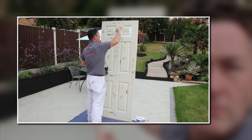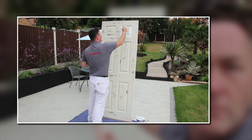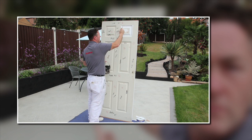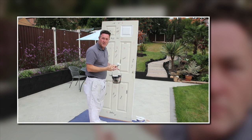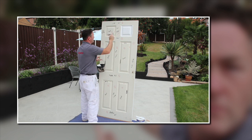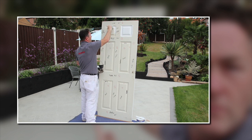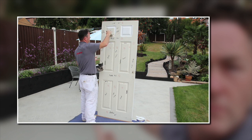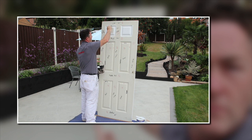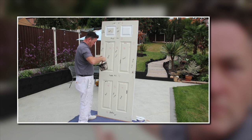Getting the paint on nicely, all the way around the sides coming into the panel. I've crisscrossed it — that's your crow's nesting. Then laying off: always lay off, get it all neat. Moving on to the next one. I'm getting my fatty edges in because I'm going to come back and do those in a minute — moldings, panel.